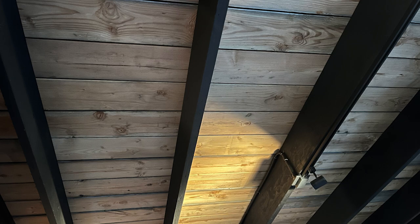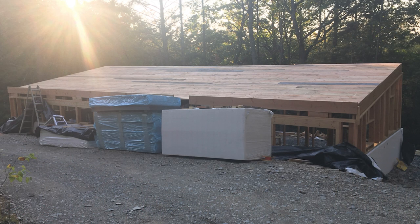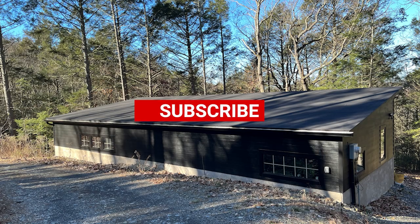This is how the finished ceiling looks. My design had LVL rafters painted black, then two-by-tens, then nine inches of rigid foam, then zip sheathing. Check out my other videos on this channel — I go into detail on other parts of this building.